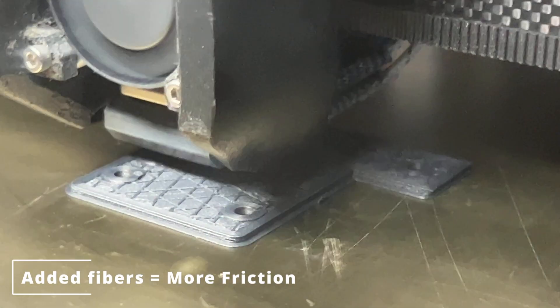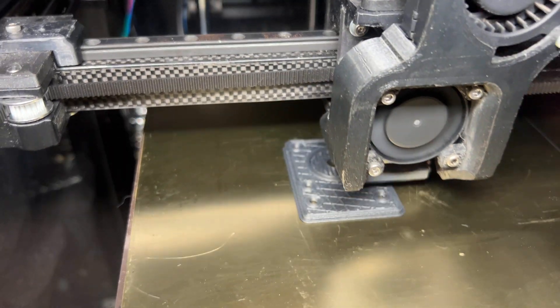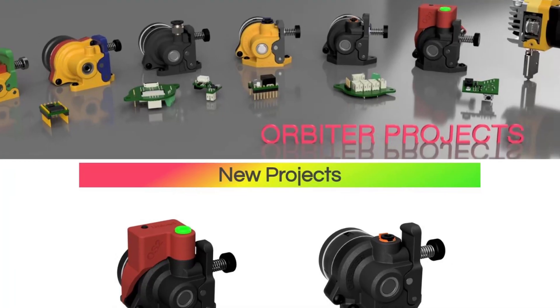But that's not all. Let's talk about the abrasion this type of filament generates. It is well known that a hardened nozzle is required to print these filaments without the nozzle hole deforming. Generally, all parts touching the filament will have some degree of wear. It depends a lot on the setup and printing speeds — slower feed rates will generate less friction, and hardened steel components will be better than copper or brass ones. My favorite setup for a worry-free experience is to combine Slice Engineering Vanadium nozzles with a double-geared extruder like Bondtech or Orbiter. All these components come at a premium cost, but I prefer to do the job once rather than constantly figuring out what to change. I'm not sponsored by Slice Engineering or Bondtech — I just find their products to be consistently reliable over time.